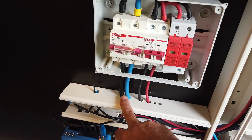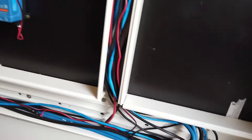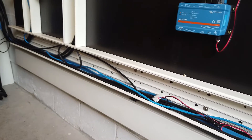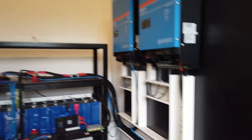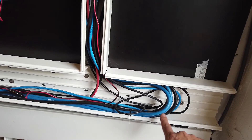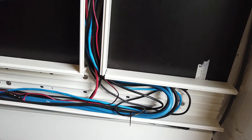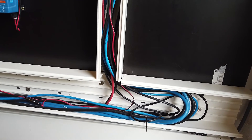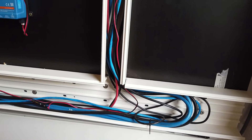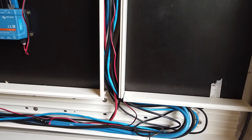The two larger cables are coming from the battery — this black and blue cable straight from the batteries, from the bus bars. Make sure you have some over-length. You never know what's going to happen in the future. Maybe you have to reorganize, maybe you want to add a charge controller. This way you have some spare length that you can use and this avoids having to install a whole new cable towards the batteries.